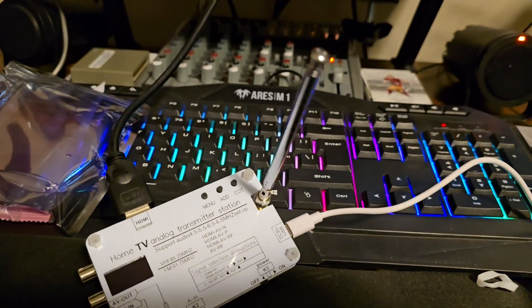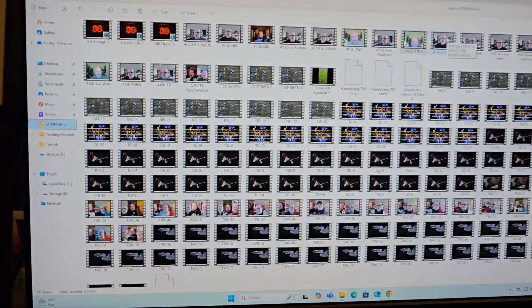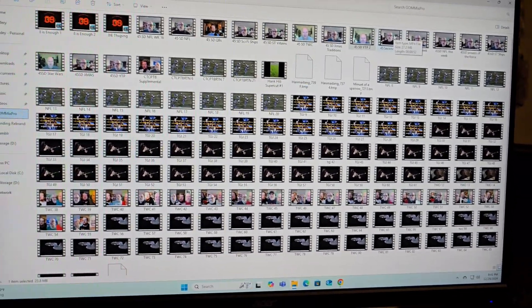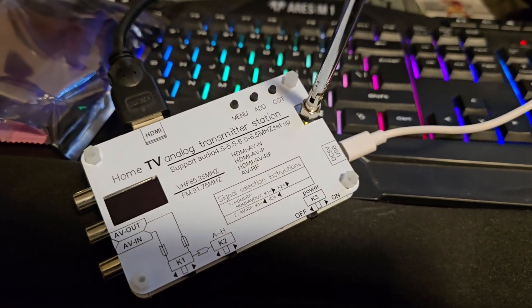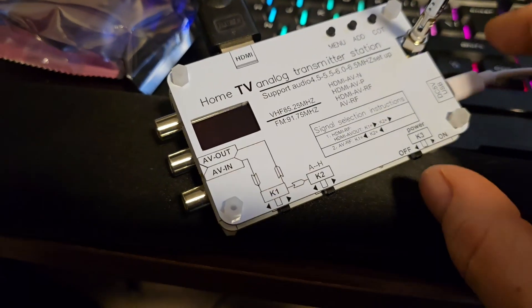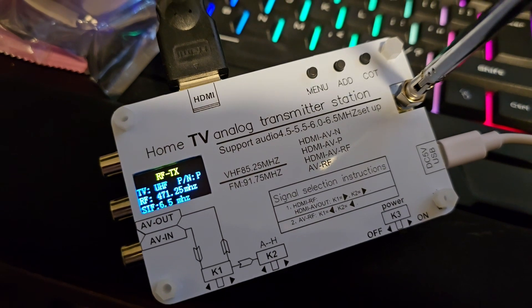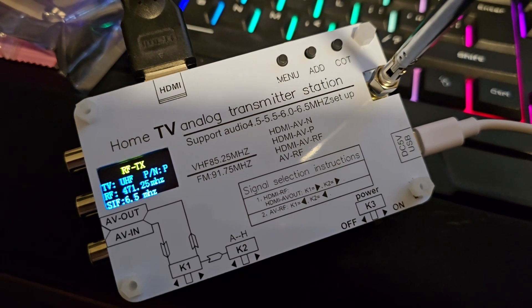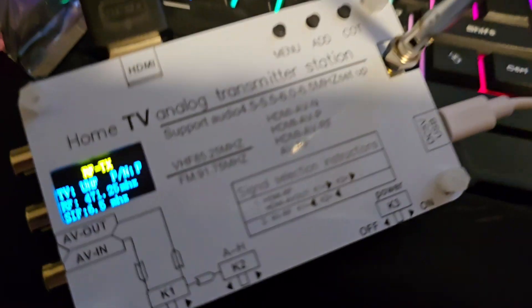As a temp test setup, we've got this connected up with monitor number two. We're going to go ahead and just wake up the computer here. You can see we've got a library of pending rebrand videos. If you're a fan of UrzaMaster, you can head over to Pending Rebrand and subscribe for all of our podcast content — some of which I'm going to try to broadcast on this analog transmitter. K3 here will give us power on. We're set to HDMI out, transmitting at 471.25 megahertz on RF on a UHF band.